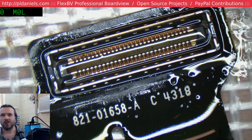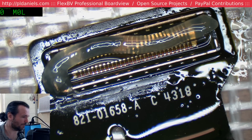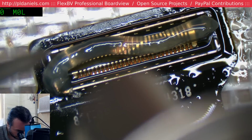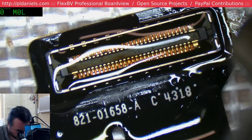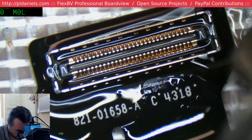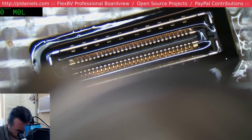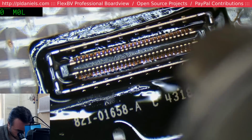Rob Brown, force of necessity, eh? Okay, we'll put some flux down, then we're going to give this a reflow, and we're not going to touch it, we're just going to let it reflow on itself, and hopefully it will come good. It's probably perfectly good for testing now. Yeah, just get rid of that junk. There we go, it's doing a good job wicking up now.